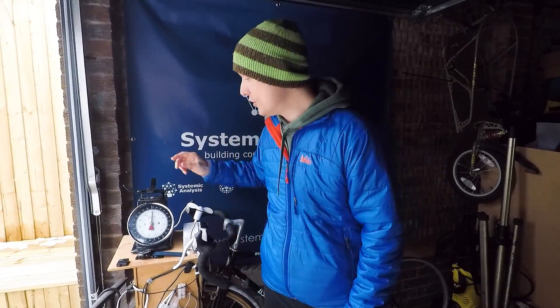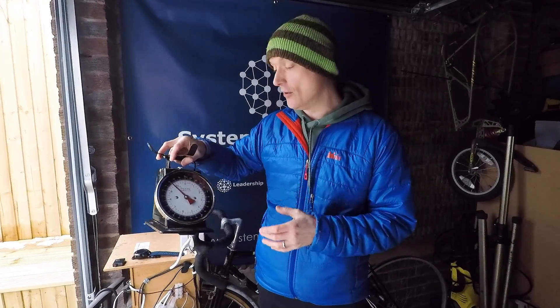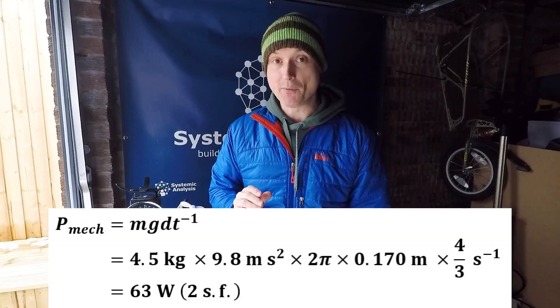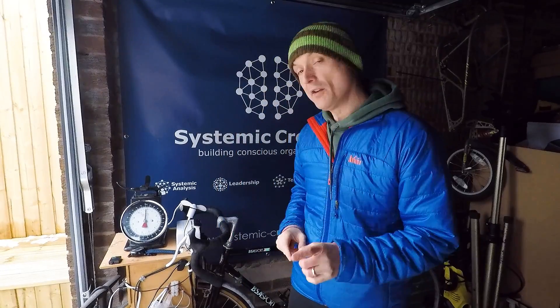So I've done all that, and I'm expecting the figure to be less than we calculated before. I re-took the measurement using our trusty kitchen scales — last time we got 5.6 kilos, and this time we got 4.5 kilos. Allowing for the fact that it takes a little bit to get the generator turning, if you plug that into our formula — PMech = MGDT⁻¹ — you get 63 watts to two significant figures.